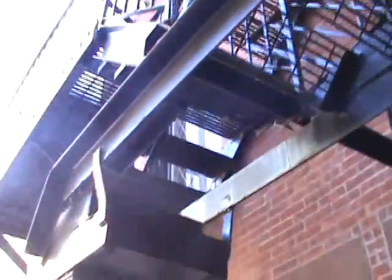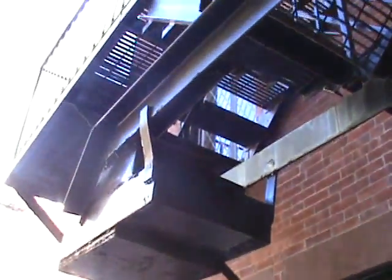And then as you start going up there, you can start seeing the same thing with the expansion bolts. Half-inch expansion bolts on that bracket up above. And that bracket up above, and that reverse bracket, which is not correct, is also adding and lending support. There's a rod that comes down here to this here. So, the fire escape has definitely got issues, and again, it's all about the connections into the building.